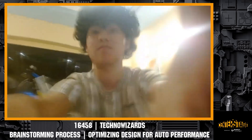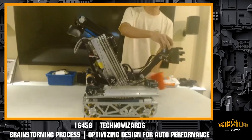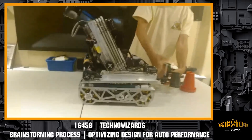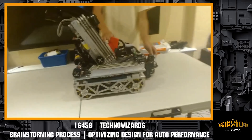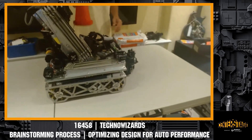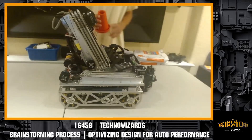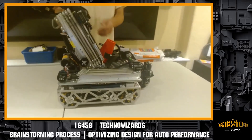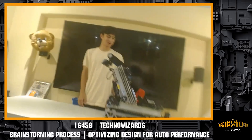A question from James Liu: can you talk more about your transfer system and how you transfer cones between the two slide systems? Our transfer system is pretty simple. We have our base intake claw on a virtual four-bar with a distance sensor that automatically detects cones. When a cone is detected, the whole system is automated. We have a funnel system where the cone can be dropped from many different positions and they all funnel back to the same spot — this solved reliability issues we had earlier in the season. When funneled in one spot, our second virtual four-bar comes down, grabs the cone, and delivers it.